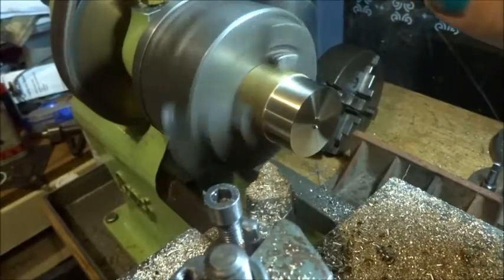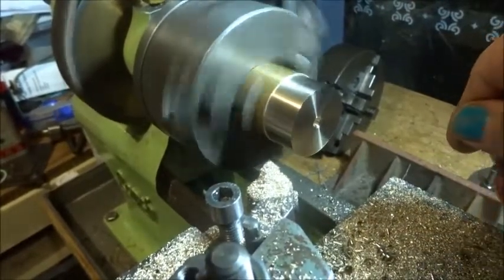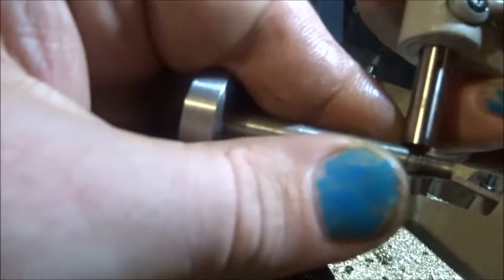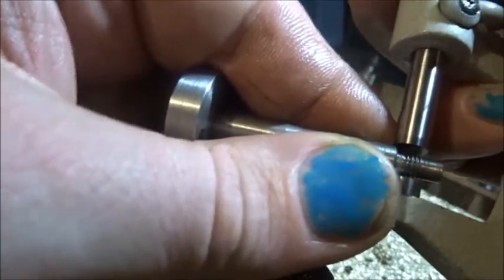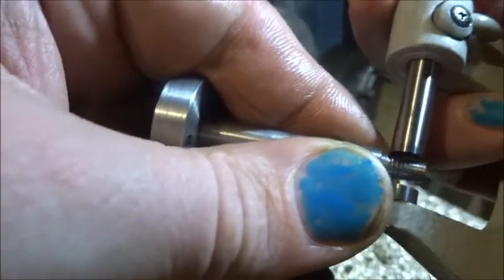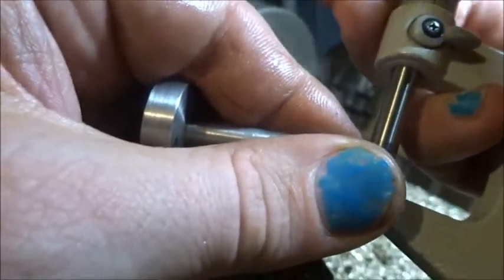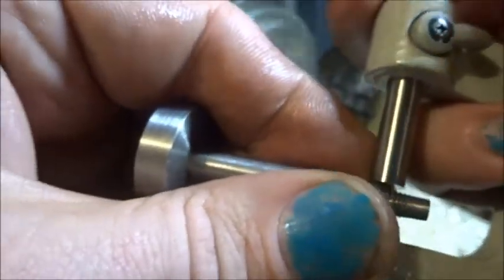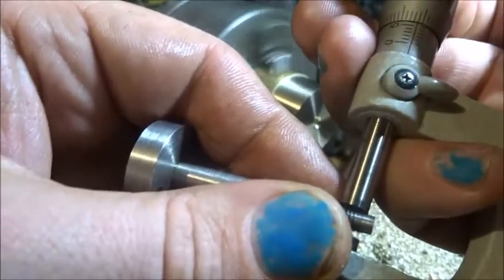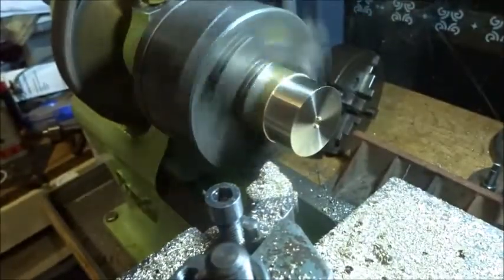So we need to drill this through a bit — bigger than this. If we measure the smallest diameter, it's about 6.5mm — 6.4, 6.2 — and the crank is about 6.7. So we've got about 6.4 there. If we drill it through at 6 millimetres, that would be a good start, and we might do that first.